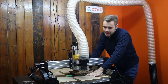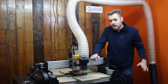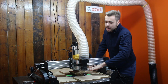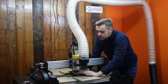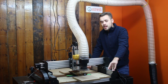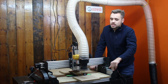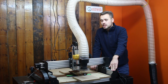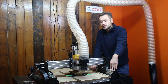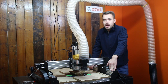So I've got the log clamped, I've got our work zero XY set, and I've got our work Z zero set to the bottom spoiler board. I've got a CAM program set up — I haven't gone through that because all it is is simply just a square which is a little bit wider than the area of this log, and it's just going to offset cut and surface the whole log. I've got the Z zero set to the spoiler board and in the CAM software I've set this to surface the log down to 40mm. We'll see how it goes and see if it takes off all this rough and uneven surface. So I'll keep this going and then we'll come back once it's surfaced to 40mm and see how it has come out.